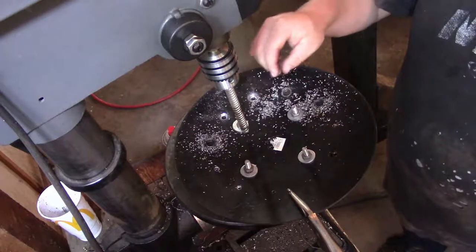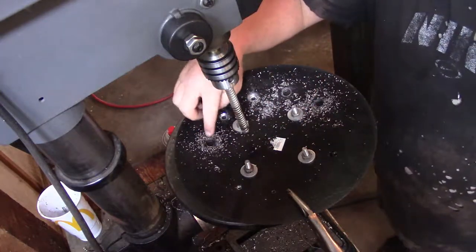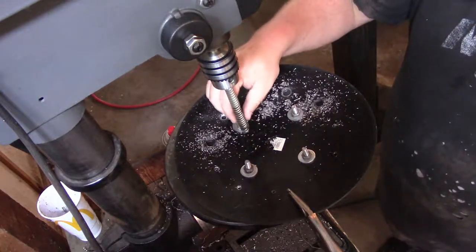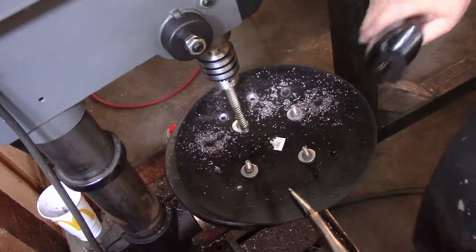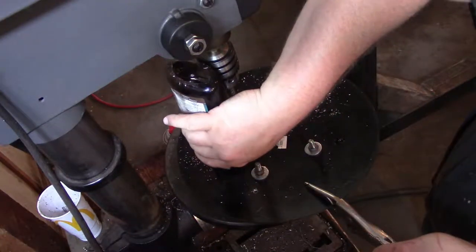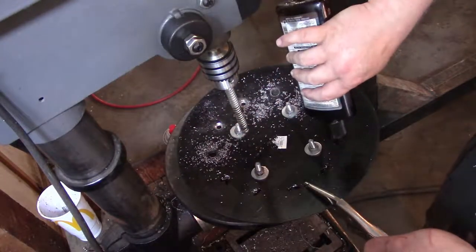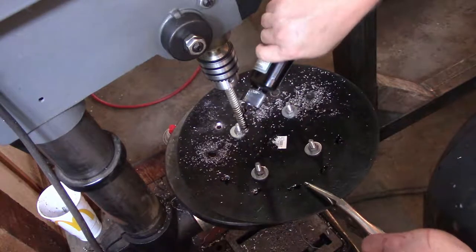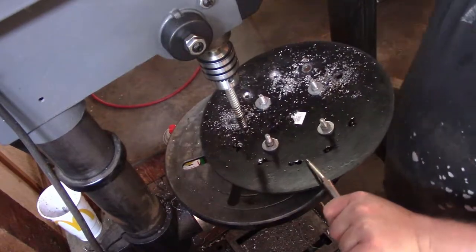You can see I'm getting some blue chips toward the end there — just a little rounded chips, but it's working and I'm really happy with that, so we'll just keep going. Put some oil around everything here and I'm ready. I'm just going to put some on this bit — maybe it's so slow that it'll slowly trickle into where I'm drilling.